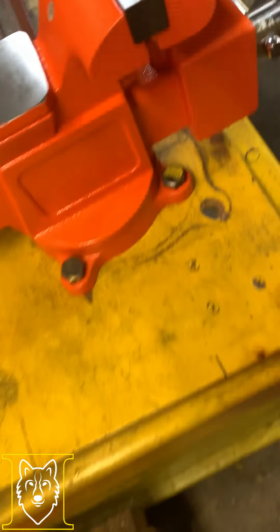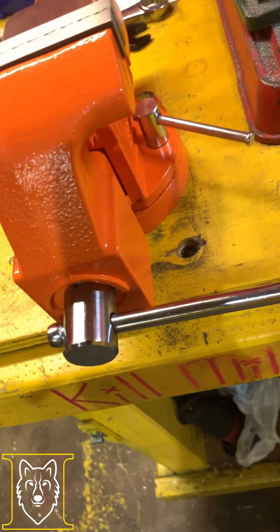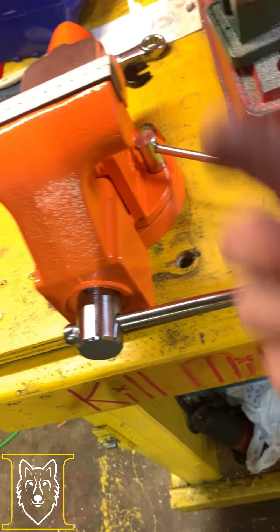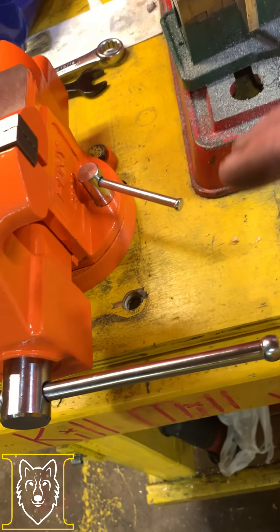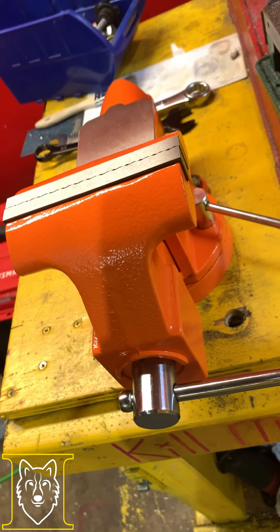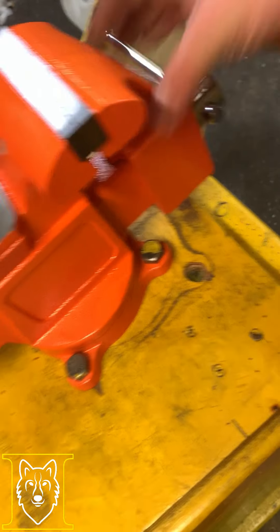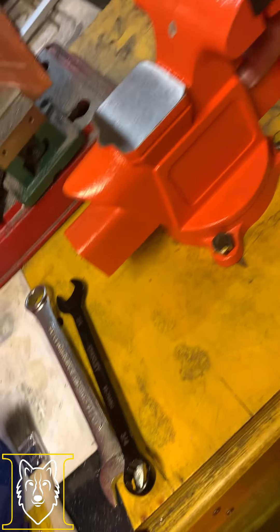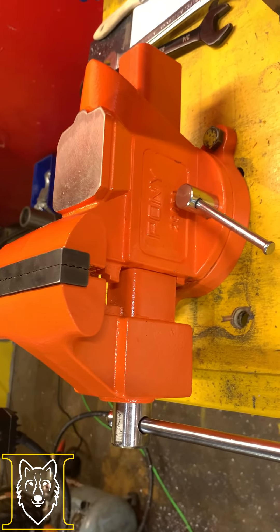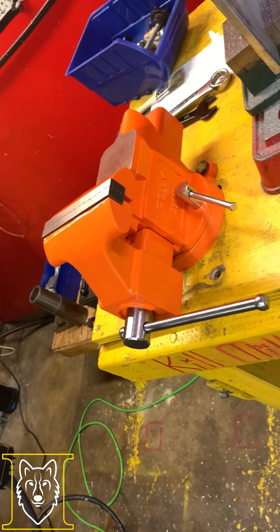Be aware that while this does fix it, I have a feeling it's probably going to cause you to lose mobility of the swivel base - which I don't like anyway, so I'm fine with it. I got that under-bolt as tight as it can get on that washer, so it doesn't move. If you still want to be able to use the swivel base, maybe just don't torque it down as tight after adding the washer, or use a washer that's not quite as thick. Either way, now it seems pretty sound. This is for the Pony brand vise sold on Amazon. I wish it had four bolt holes instead of three, but anyway, maybe this helps somebody out. Take it easy.